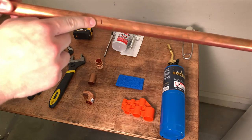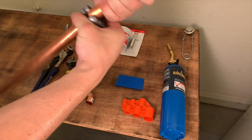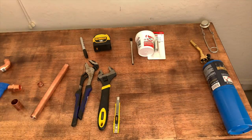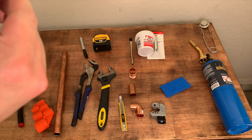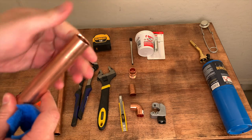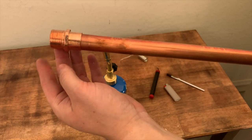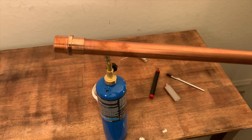I've already marked where I need to make my first cut, so I'm just going to use the pipe cutter to do that. After the pipe's cut, we're going to deburr the inside and outside, then use the abrasive pad. A lot of people use a wire brush on the inside too — you just want it clean and smooth. I'm going to repeat this for the other ends. I'm going to solder the male pipe thread fitting that goes directly into the water heater first — and because it's so close to the plastic tank, I'm going to solder it right here and then hook up all the rest of the piping and solder that in place.